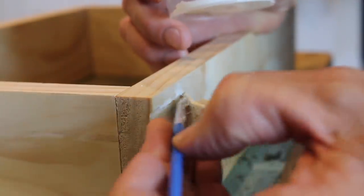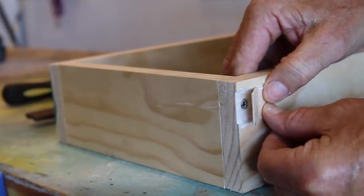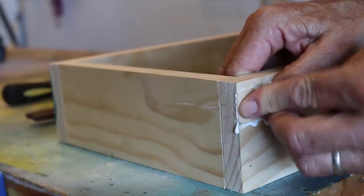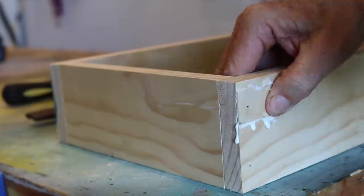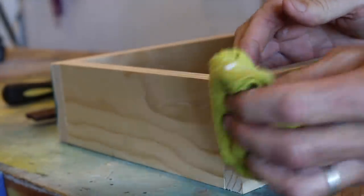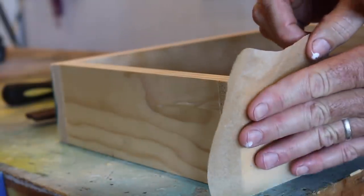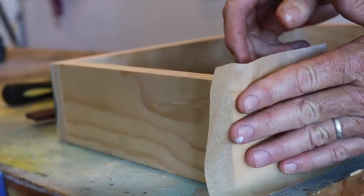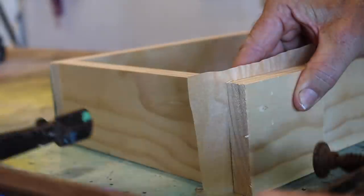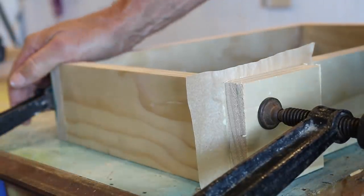That looks pretty good. Now it's time to close this up. What we need to do now is just gently place that thin veneer of wood back to where it once was. Squeeze that excess glue out, just like that. Then give it a bit of a clean up — because you don't want glue everywhere — so clean that up with a wet rag as much as you can. Pro tip: with that baking paper, if we place it over that surface, if any glue comes out, our clamp isn't going to get stuck to it. Now we'll put a block over that so we don't damage the wood, and then we'll just clamp this nice and tight. We'll come back in a few hours' time and see how it looks.